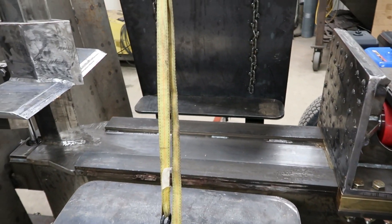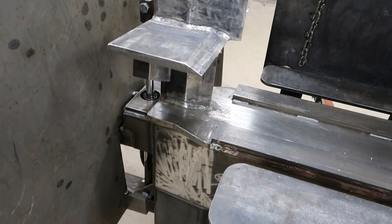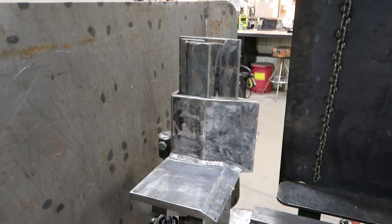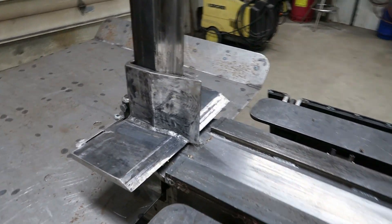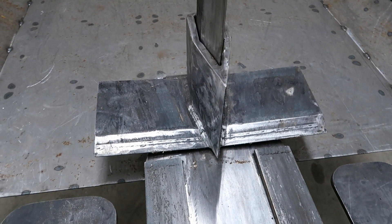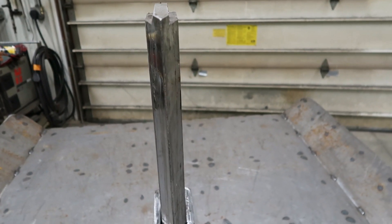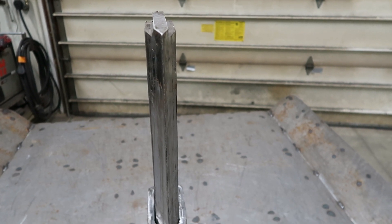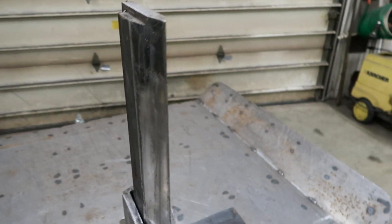It's still a 30-inch stroke. I finally got my hydraulic wedge — that's a 2-by-12 cylinder on there. Looking at the wedge, it's all built out of 1055 beveled-edge steel, like a cutting edge material. The main beam is laminated: the center piece is three-quarter inch and the two side pieces are half-inch.